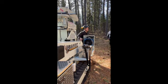So as long as you guys know, by the time we take off out of here, this is a brand new piece of rubber. It is going to need to be adjusted. Bandit's sticker here is going to say after the first 2 hours to check the adjustment on that belt. Follow this sticker. 10 to 20 hours, guys, is really when you're going to see that belt start to stretch. Now, if you take this out, you're hogging 12-inch logs through it right away. Check it after first 2 hours. Well, check it either way for the video. But realistically, guys, when that bigger wood starts to go through, that's when that belt's going to start to stretch.